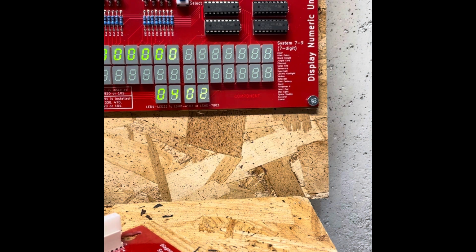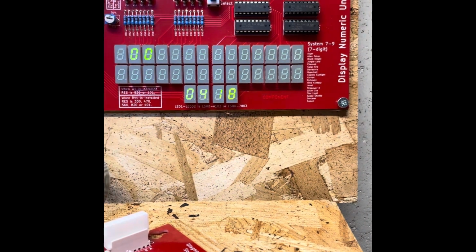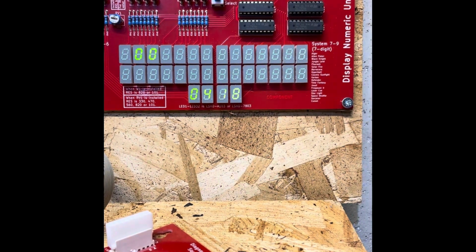And then I went ahead and set this to free play, but I believe you're actually having this on location. So I'll take it off of free play there. But basically it's just setting 18. And then you want to set the max credits to 0, which is done just by pressing the start button whenever you're on selection 18, if you do want to go back to free play there. But everything is all good to go.